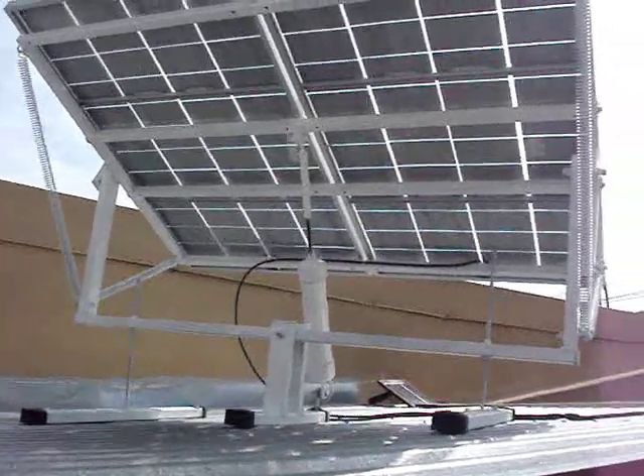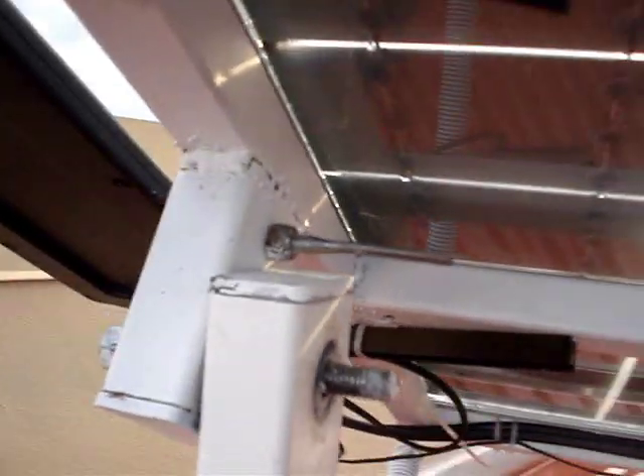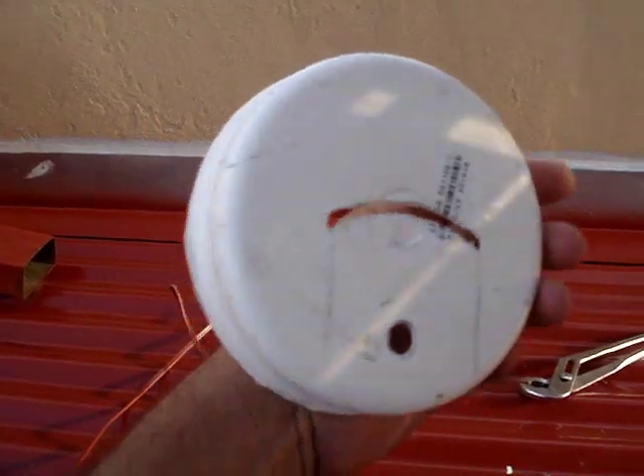I start with the metal finger that I build out of a piece of 3/8 rod, and I shape that into a flat wedged shape piece using a grinder. I bolt that above the pivot point on the main tracker.